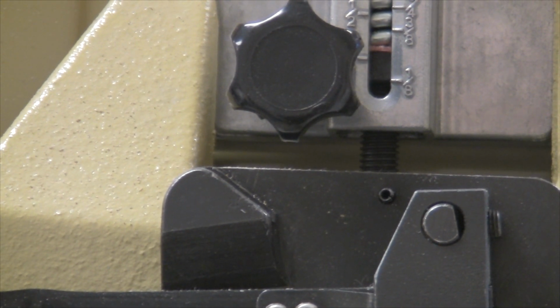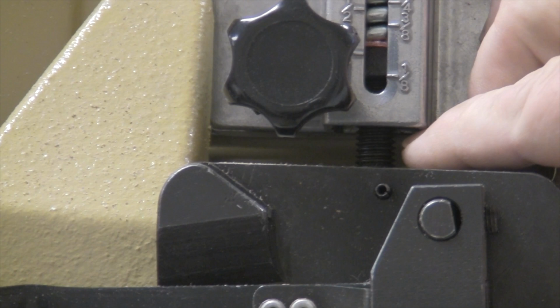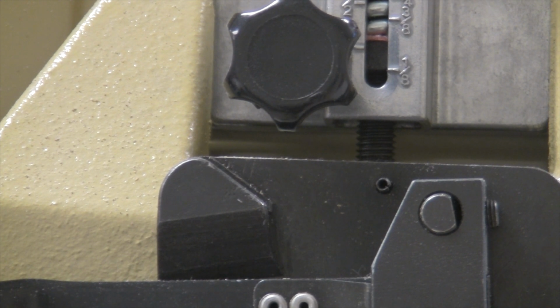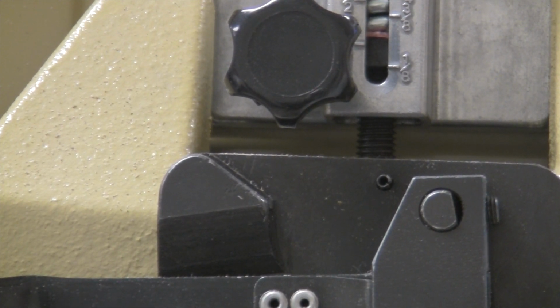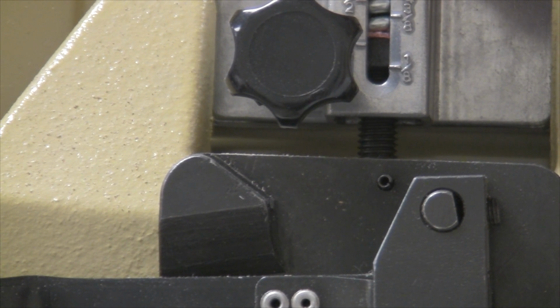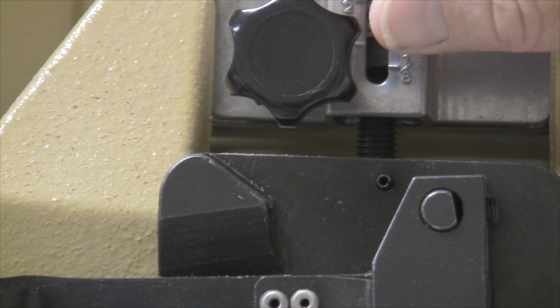If you loosen up enough tension, that thing will come down below this point, which is okay. But when you go to start putting the tension on, if that thing's not turned right, where it goes straight, the square part goes in the square there, it hangs up below, and you keep tightening this tension over and over again, you will break the whole mechanism inside of here. That bolt there, between here and here, breaks. We didn't have this thing 5 minutes' worth of use before we broke it and had to order parts for it.